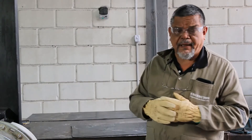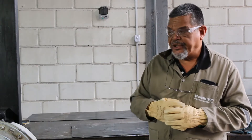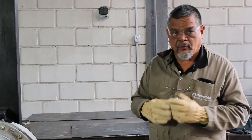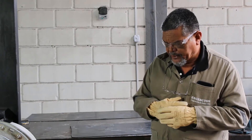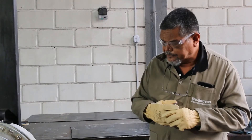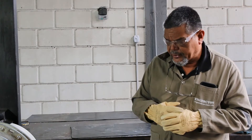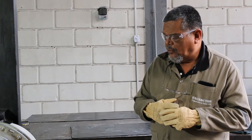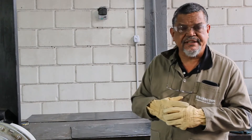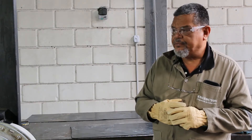As the pipe is lined up, welding may proceed using the conventional welding process used everywhere in pipeline construction. In this case, we are using cellulosic stick rod. Other welding processes could also be used — the system is not dependent on the welding process used.